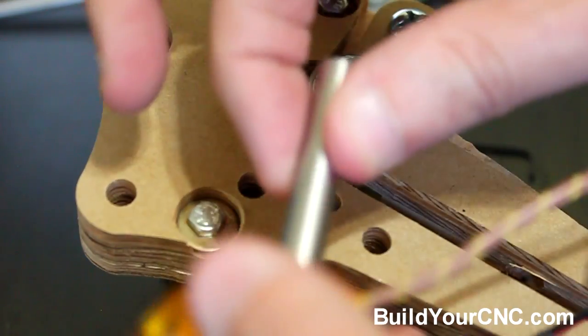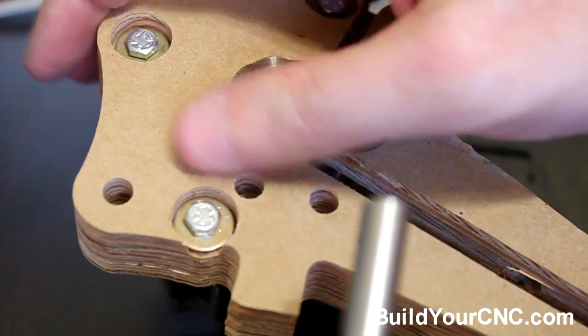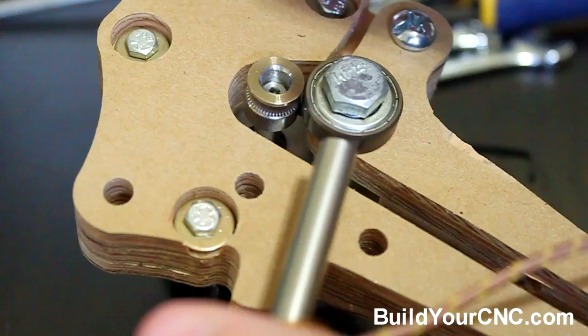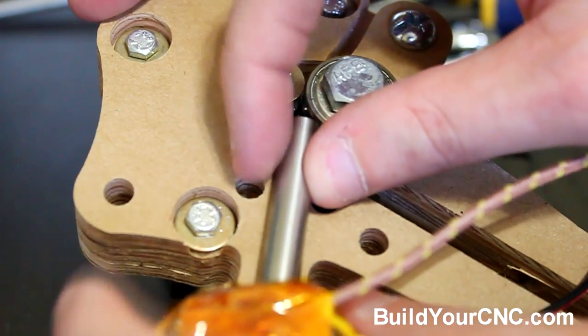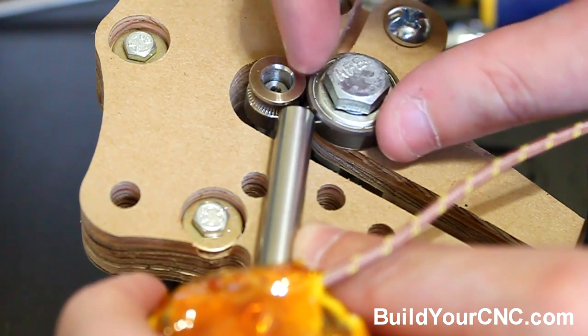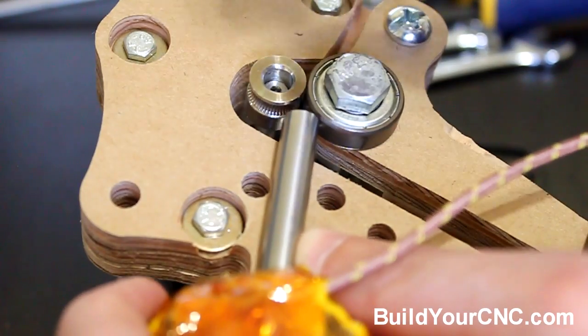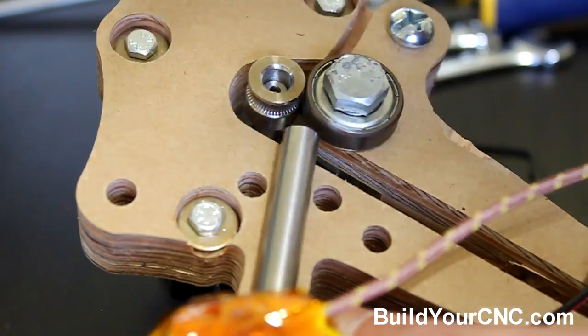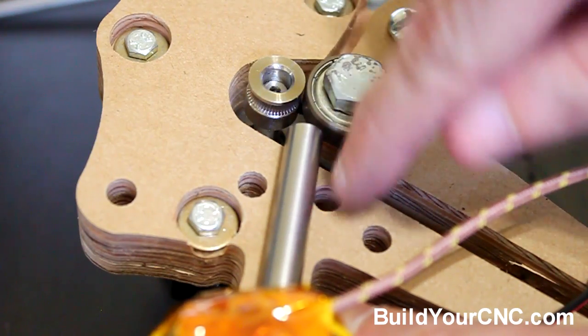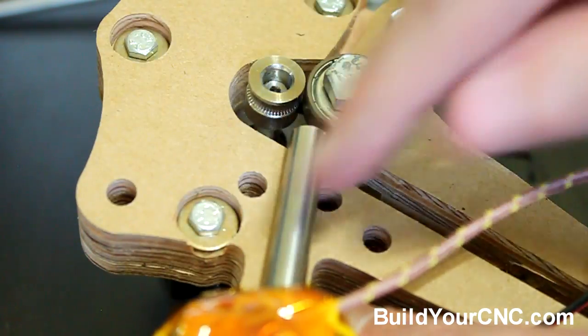You'll also notice using this new extruder versus the old one — the old one had a much larger diameter. The older extruder structure had a depressed area, but that's not needed with this particular extruder since the PTFE hole in the middle aligns very well with the bearing and the serrated hub. It doesn't have to be all the way up; you can bring it down just a little bit, and then we can put a tie around this location and a hose clamp around this location to keep it in place.